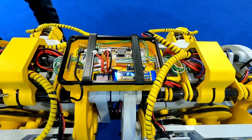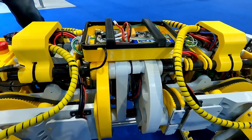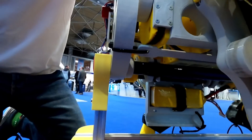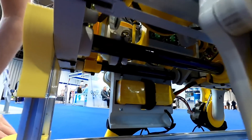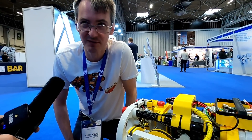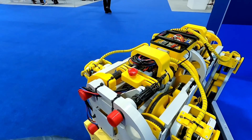You've got a battery on the top here, presumably for the logic, and there must be another battery somewhere else for power. Yeah, just a little lipo on top — just five volts for everything, with a 3.3-volt reg on board. The main battery is underneath: a four amp-hour six-cell drone lipo 60C. It still gets hot because I'm driving every axis as much as I can, which is 30-amp peak across 12 of them, so I'm drawing about 300-and-something amps peak from that battery, which gets hot when it really shouldn't.